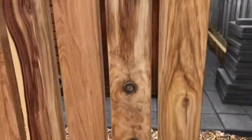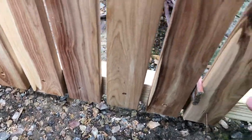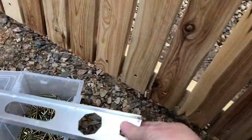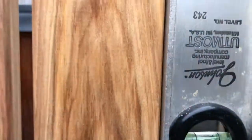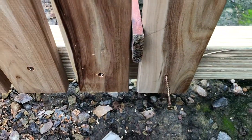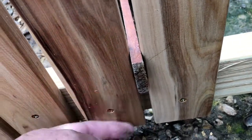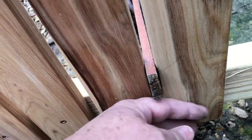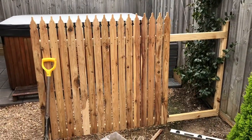Okay, that's stage one — gaps right, heights right. Pull that down so it doesn't drop on your head. Down here I've got a shorter stick — poke it through from behind like that. Get your spirit level, stick it on, hold it tight — it's level. We do up that last screw. I screw them so they go just a little bit beyond flush — that way when you're brushing or oiling there's no catching on them. Poke that little spacer out, bring it across for the next one, and there you go — in no time at all you're going to have that all looking beautiful.